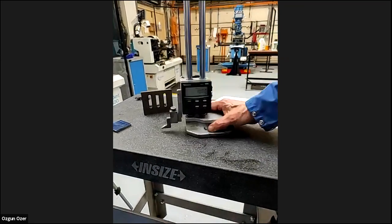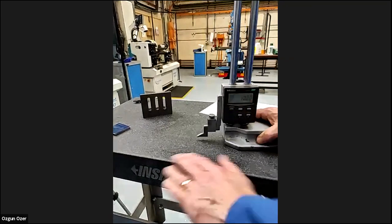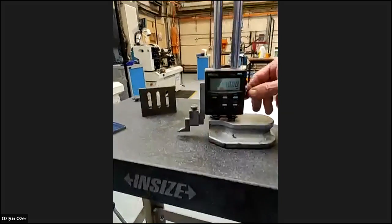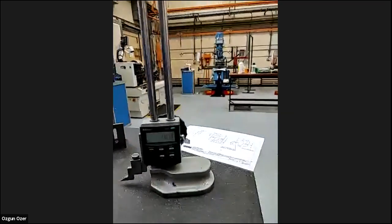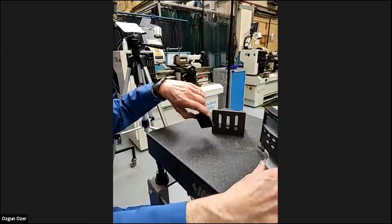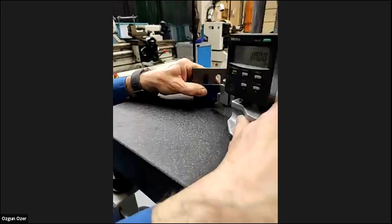We use our hand just to move it around a granite block, which is perfectly flat, so there's no bumps. So did you fix it now to 10 millimeters from the surface plate? Yeah, that's 10 millimeters. I set my zero, moved it up 10 millimeters and locked it at the side, so we can mark a line on our job now. I've got a square, so I can put my job on there, hold it with my thumb, and then mark a line. I'm just going to mark that corner. Square dot line, 10 millimeter.